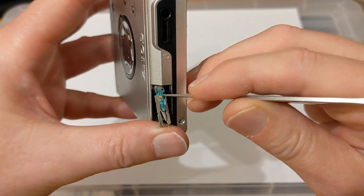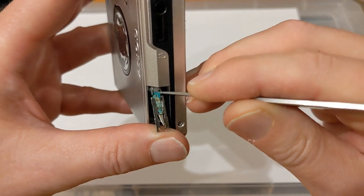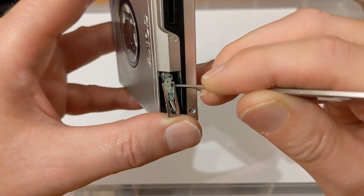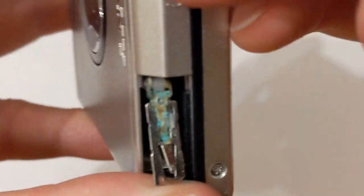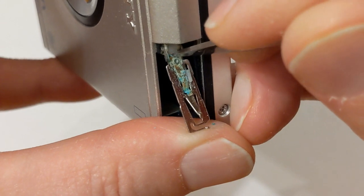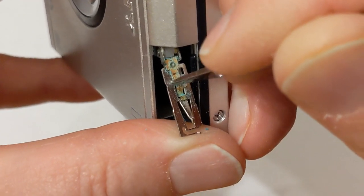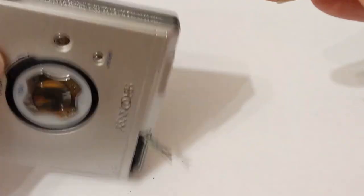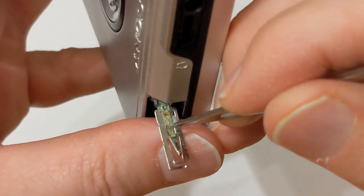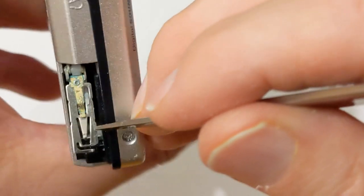What I'm going to do is scrape some of this greeny-blue battery corrosion off here. If you haven't seen this sort of thing before — a quick recap: when alkaline batteries leak, they leak out of the positive electrode. The liquid that comes out is corrosive, it goes a funny color, and it basically eats away at everything — the gold on the contacts, the metal, the plastic, the whole lot. I'm going to zoom in a bit more. All I'm doing is scraping off the worst of it without scratching the underlying contacts, being very careful. And because it's alkaline, you can neutralize it using a mild acid.